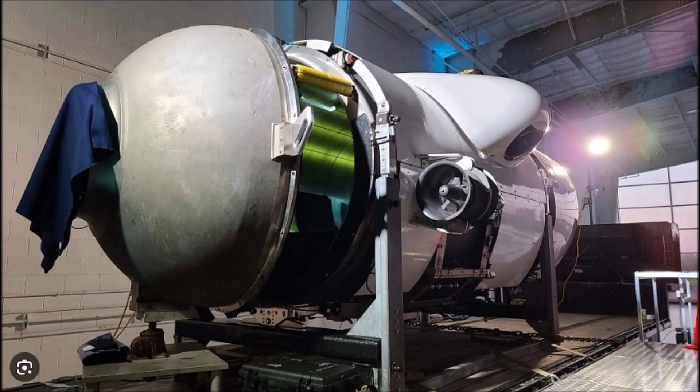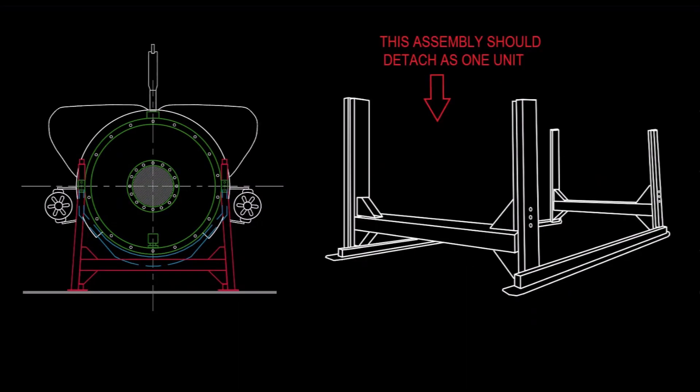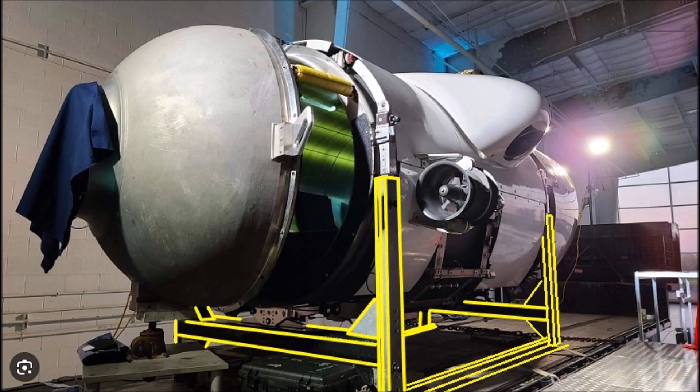It's not clear to me exactly how the legs were intended to be released. I assume that the pins holding the legs onto the interface rings were at the top somewhere. These were apparently pneumatically actuated, which in my mind does not provide sufficient strength to do the job, especially not after several dives when parts could be all crusted up. This leads me to believe that perhaps one of the legs did not detach when they were performing their emergency protocol to drop the legs. When dropping the legs, the skid frame assembly should in theory detach as one piece. Here are the legs on the sub for reference — there seem to be other things attached to it as well, but I'm not sure what they are.